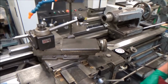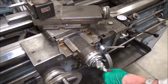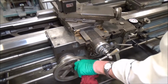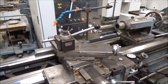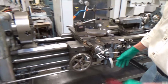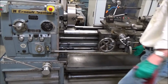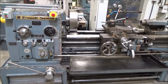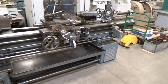Overall, just from a mechanical standpoint, cross slide, you see my hand in the cross slide moving right there. And that's about 20 thousandths backlash. And that's in pretty good shape. And maybe about a third backlash. So that's about it. Aside from my phone ringing, we're in pretty good shape here, you know. Yeah. And an emergency stop. I think that worked. Let me see. Fine, that works too. And that pretty much wraps it up, I guess. Yeah, that's we got good. Everything covered. How about that? Very good. Okay, thank you. Done deal.